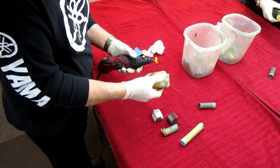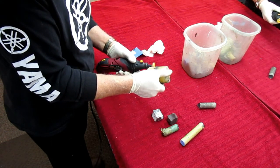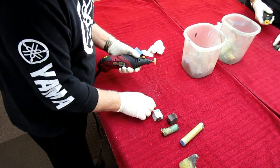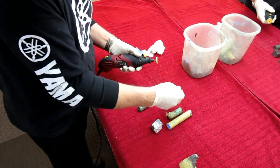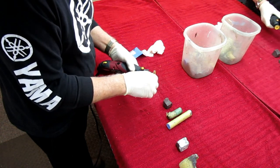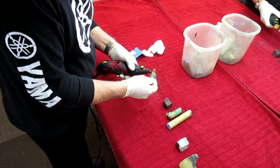This is ordinary wax, candle wax. Just want to put some on the wheel, and usually the wheel's going to throw threads all over the place until you get it broken in. Now, the roughest of all the compounds, black is the roughest, red is medium, so is green, blue. Each one of these you can buy, but right now I want to try the roughest of the compounds. And let's just see if this works. I'll show one in real time. And then I'll try the rest of the compounds and see which one seems to work the best.